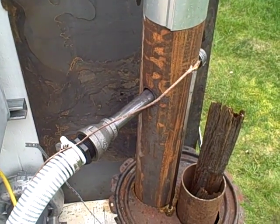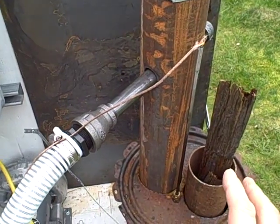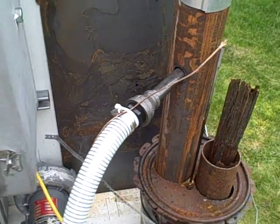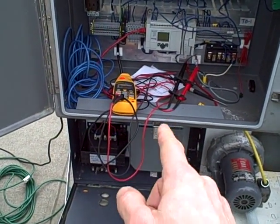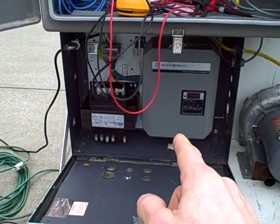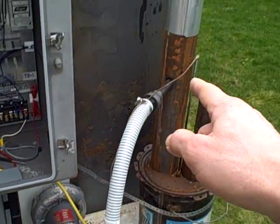This is going to give us a sense of control over the rocket stove. We're hoping to exert more control over the stove than we'd have otherwise with its own natural draft. We're eventually going to be controlling this with a PLC, which is going to be sending a 4 to 20 mA signal to a variable frequency drive right there, driving a three-phase fan motor that's blowing the air to the stack.